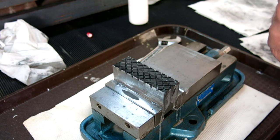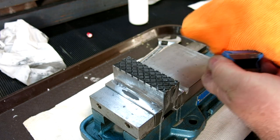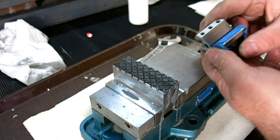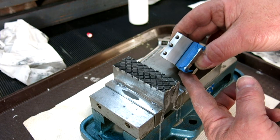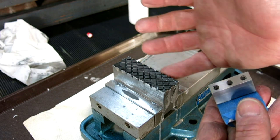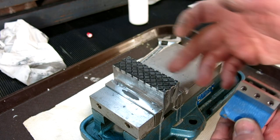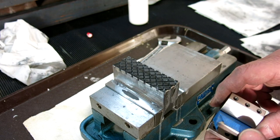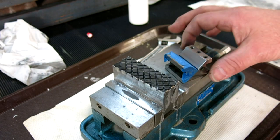That's maybe 10 minutes later. Let's see if I can show this on video — spend a lot of time cleaning. It's starting to come up nice. I put some tape on this side to protect it because it's kind of tracking along the side of the lap, and this side hasn't really had any preparation so it's just a guiding surface now. We'll work that a little bit and then switch to diamond once we get it looking pretty good.